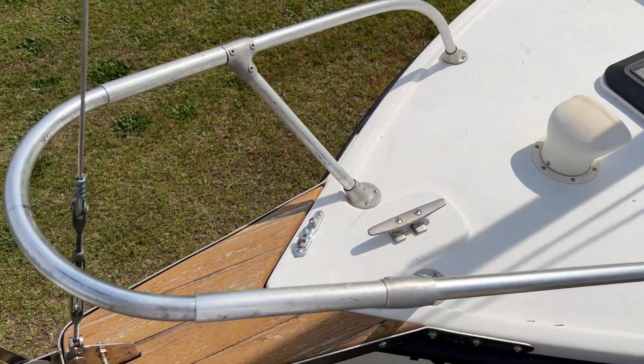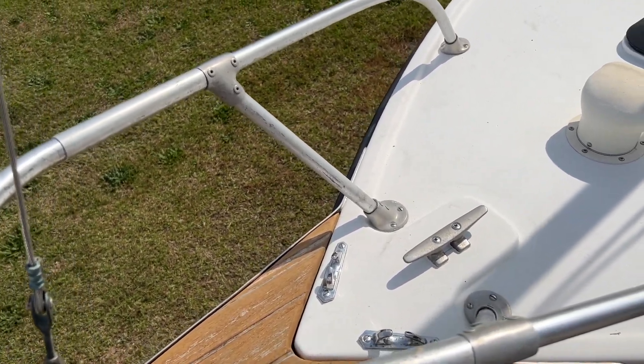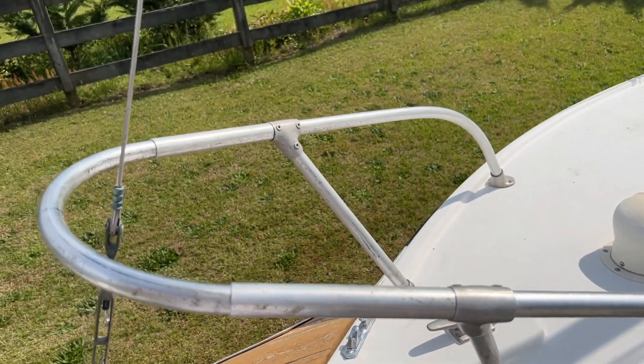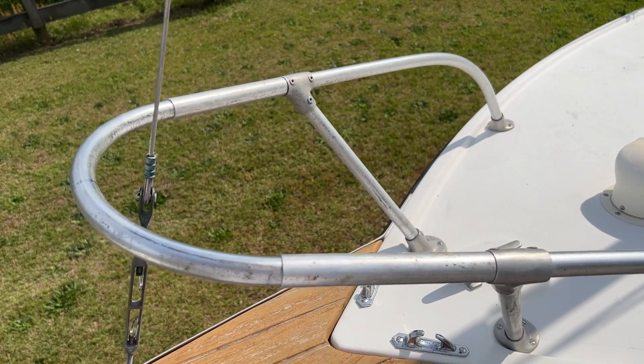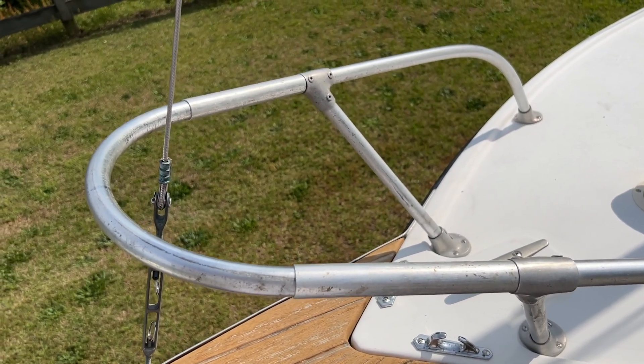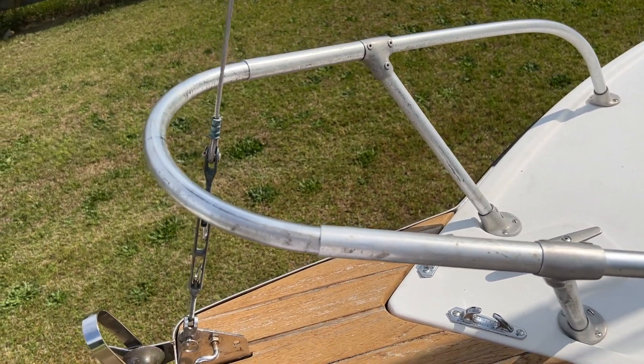There's what I did. I just cut it in two and put in a short piece of aluminum tubing — one-inch tubing over seven-eighths tubing. It's a nice, tight, snug fit with that aluminum. I had stainless, but I went ahead and used aluminum just because it matches better.